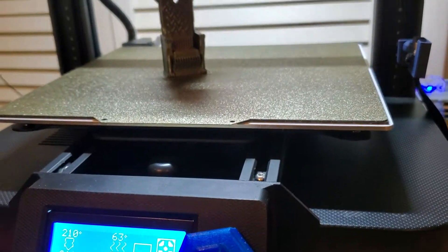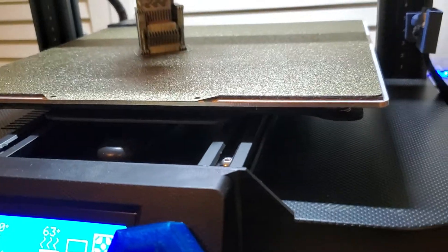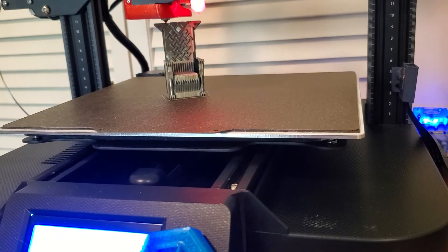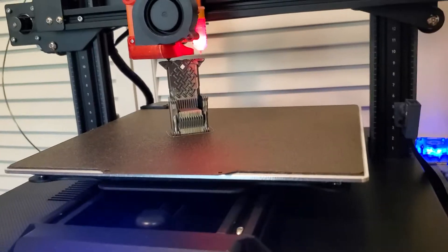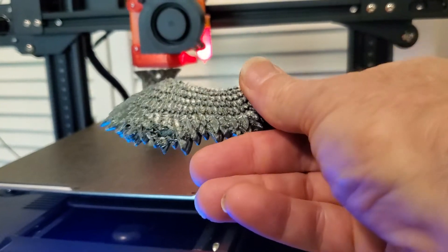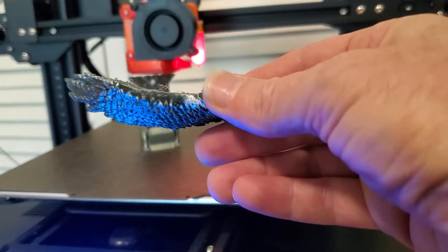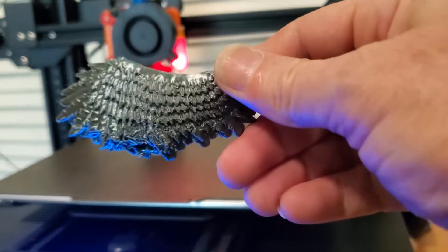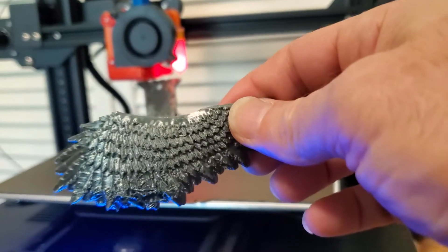This print is about to be done, so it's kind of nice to see it finish up here. Sorry for the lighting — my lighting's on the top, but let me get better lighting here. I did print a few other things — printed some wings for another model. That came out okay but not great, because I still need to really calibrate in. The detail is great, but what was difficult were the supports. It's not printing tree supports at just one-wall thickness all that well right now.